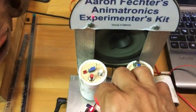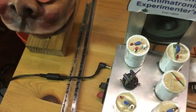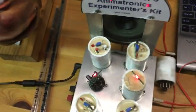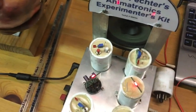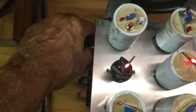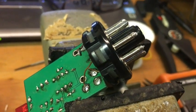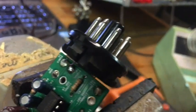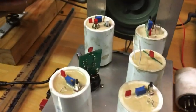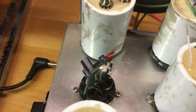No good. We'll re-solder all the pins. I haven't figured out what's wrong here yet. I put on the power, I talk in the microphone, nothing comes out. I touch this and it makes a lot of noise. I don't know what the problem is yet. So I'm going to test continuity between the pins and the wires coming out of them. As I suspected, they're all coming out, so it doesn't seem like there's anything wrong with the solder joint. I've re-soldered the wires and it's still not passing any signal. I'm going to quit now and come back fresh.